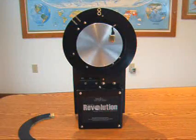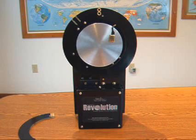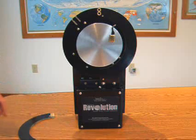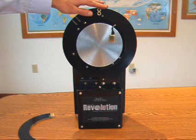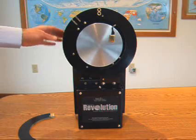As you can see, I've already completed the next step in the installation, which is mounting of the master control unit to the customer supplied bracket. The flange on the back of the enclosure has four mounting holes, for up to quarter inch screws. I've also attached one half of the power coil to the master control unit to aid in alignment of the master control unit to the rotating collar.